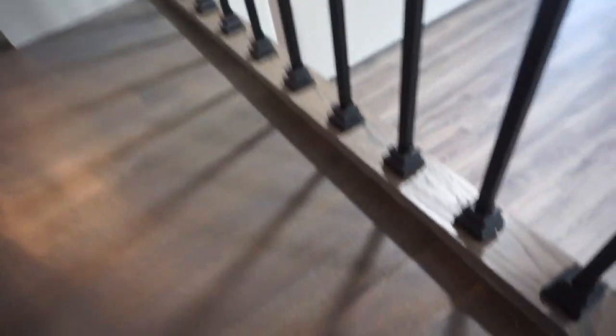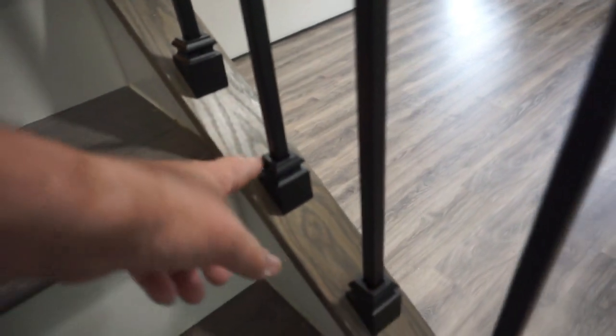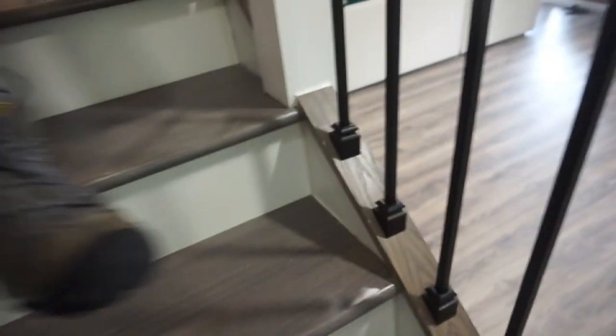As we go up the staircase we have all solid oak treads stained to classic gray. We have a solid landing — two-and-a-quarter inch oak sanded and finished in place and then stained classic gray. We neck-cut it on two of the sides because it's pretty small, and left extra expansion on the other side. We have our 6010 handrail and a satin black half-inch iron baluster with a shoe at the bottom.